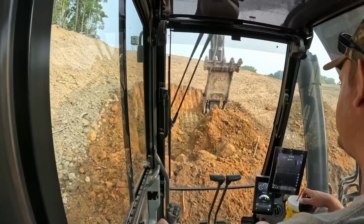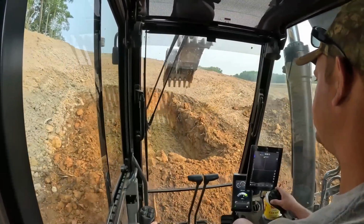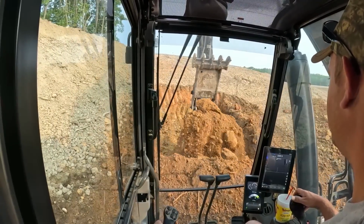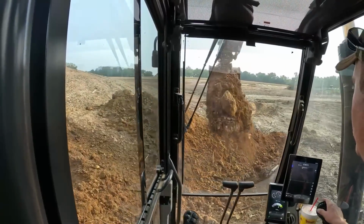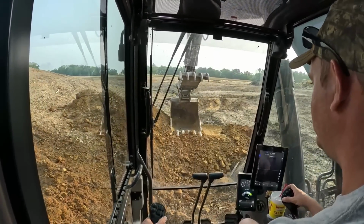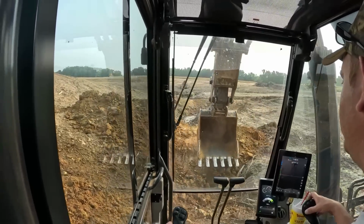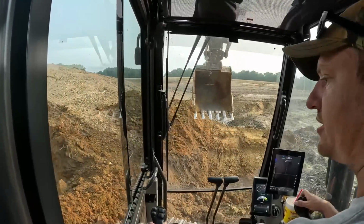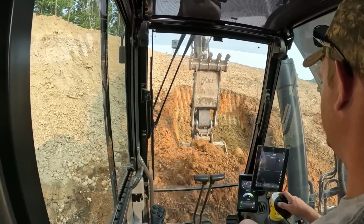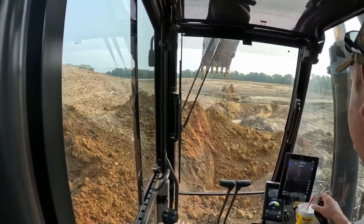Solid base there, about 5 feet deep or so. Those should fit in there. Dump my clay and get it all compacted in place. Technically my second cofferdam. Keep that packed in place, and I'm going to continue to dig this out, separate that mud out, and then it'll be time to go dig some clay and start hauling it over here to fill this in some.